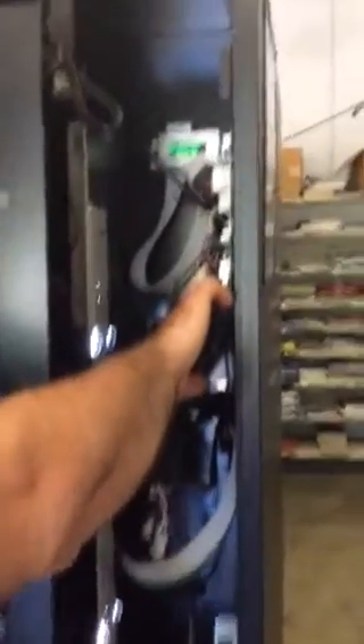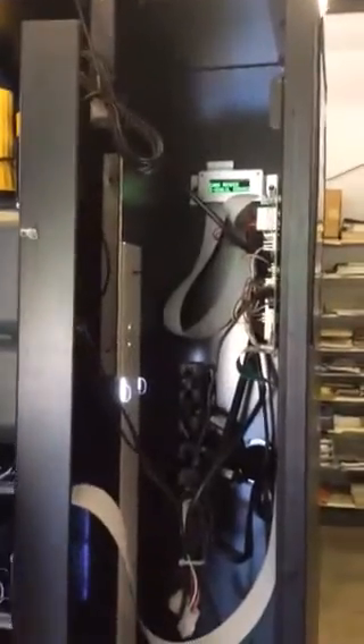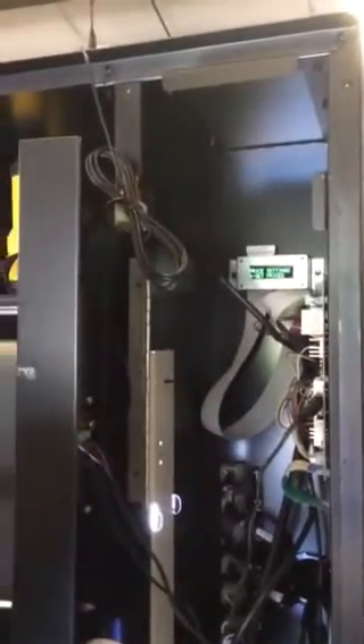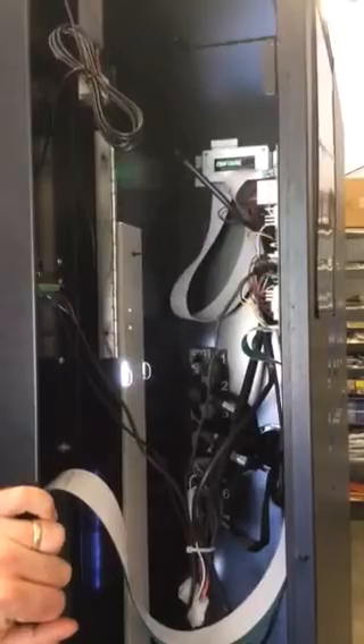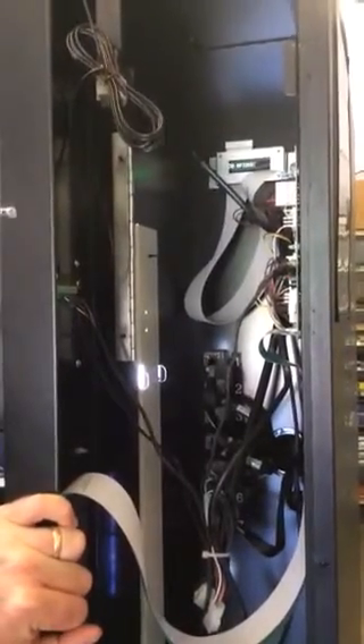The steps to the process: hit the yellow mode switch, use the pound button on the control keypad to go to tray setup — should be seven clicks. Once you get there, hit six. The machine will start to turn; it's configuring the number of motors in the machine.